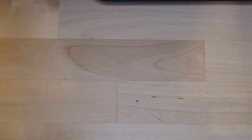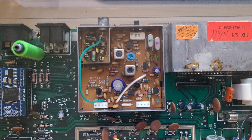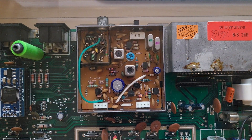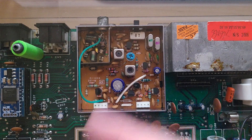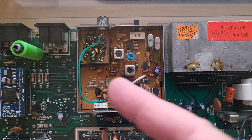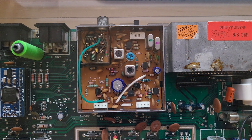Now that you've got the video signal through HDMI, it may not be as clean as you'd like — it might have jail bars, color bleeding, or just not be very sharp. So now you can clean up the video in several ways. One of them is Adrian Black's system. If you have a modulator that looks like this, a link to his video is in the description. If you have some soldering skills, you can eliminate a couple of capacitors, changing the filtering in the unit itself to clean up the picture on the modulator side.